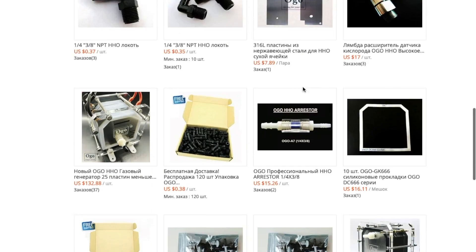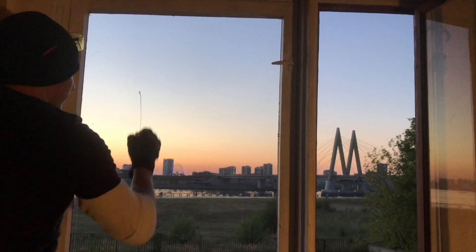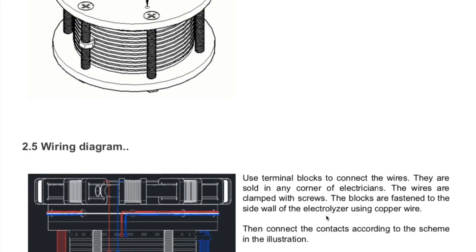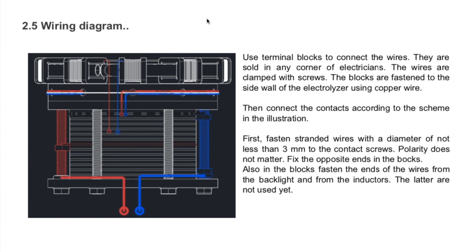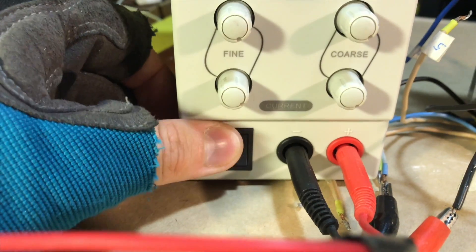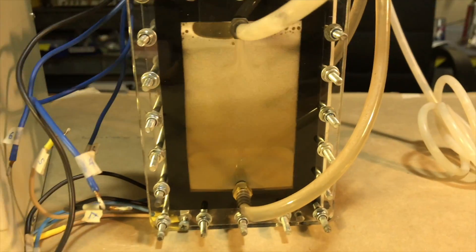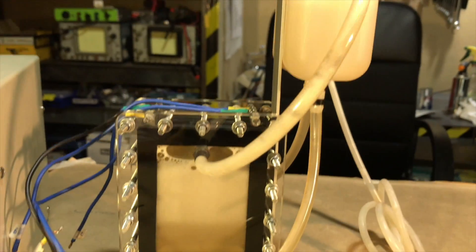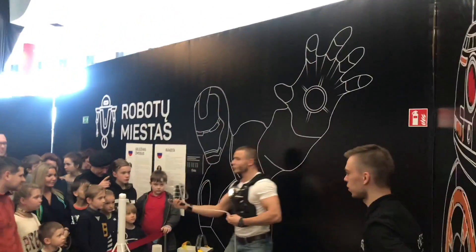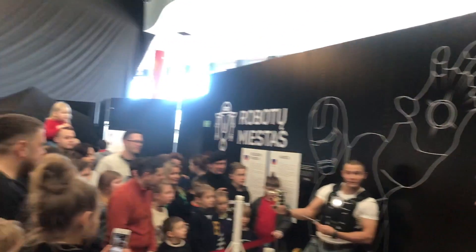The simplest model has 13 plates. The plate configuration and connection are exactly the same as the Iron Man hydrogen reactor. Powered by 12 volts — negative wire to the first and last plates, positive to the middle one, other plates are not connected. If you use it as a flowing electrolyzer so that foam and water circulate through the system, it will produce about half a liter of gas per minute without overheating. Without other tanks it gives only 100 milliliters per minute because at high speed the foam sprays through the top.